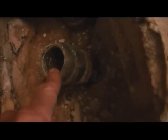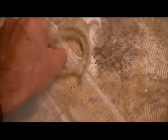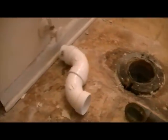I had a boot that I put on, but by the time I put a 45 going this way and a 45 going that way, it was two inches off the concrete — that's not going to work for my drain because I'd have to do filling for the difference. There's a little tool I bought years ago that's supposed to cut inside the pipe by moving a wire back and forth, but it has never worked any of the times I've tried it. So what I normally do is use a Sawzall blade — you bend the blade as much as you can so you can get up inside there and do the cut.